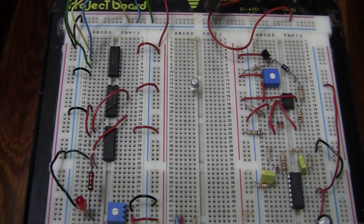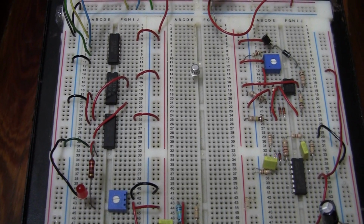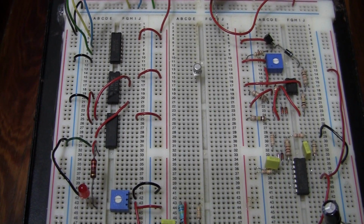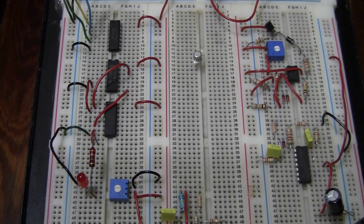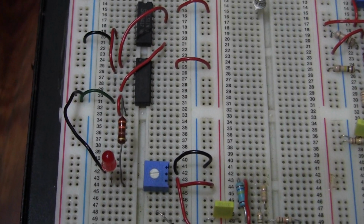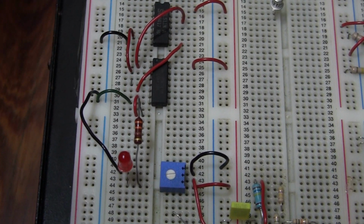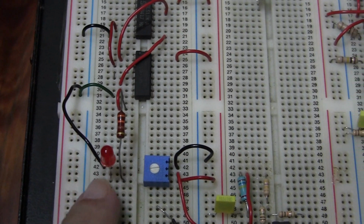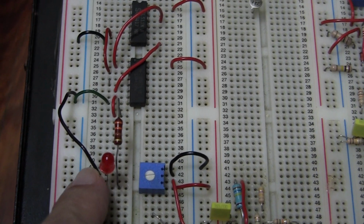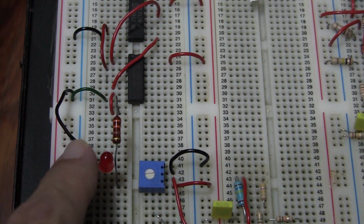What we have added between 6:54 in the last video and now is the LED and the 3 wires going from the AND gate outputs to the OR gate. So we're going to zoom in now on that so you can see it. You bring a black wire from the blue rail as shown to the cathode of the LED. Then the anode of the LED, the cathode is the one with the flat spot. So the flat spot is away from me, away from my finger, and connected to the black wire.